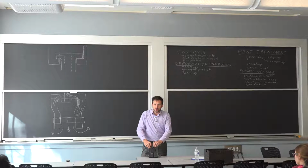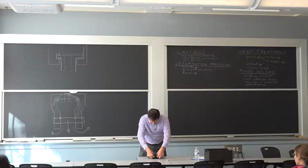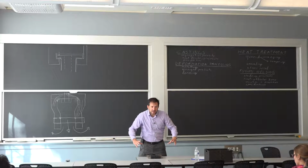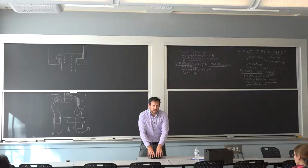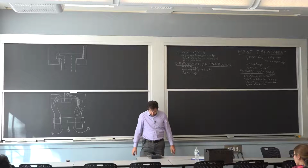Now, steel is not going to make you a fluid-tight seal. So there is a very high-quality elastomer between the two plates. It's a sandwich construction, a little bit like an O-ring. By the time it's closed, it's steel for the first 6 millimeters, steel for the lower 6 millimeters, and then the elastomer is confined in that space. One property of elastomers is they don't really compress. So as you keep energizing this, it can't go anywhere, so you build very, very high pressure into the elastomer, and that's how you get the seal. The purpose of the metal is just to hold everything in place, and then you make the seal.